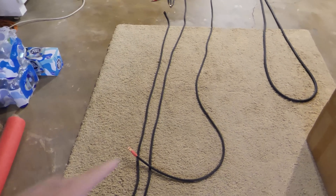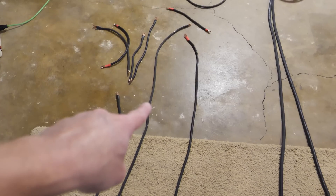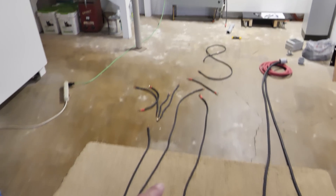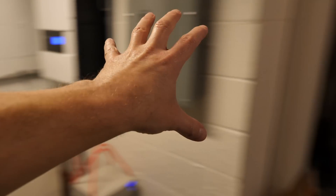Another thing I've been procrastinating on is the wiring. Right over here is the 2-0 wire, and right over here is the 2-gauge wire from the previous Powerwall. I've been redoing some calculations on how many amps I'm going to use, and what I think I can do is use the 2-gauge wire because I just have enough to go from the bottom box and the top box over to the metal box going right over here. So if I just go with the 32 cells and not the Rhino or the Husky or anything like that, over to the 12,000-watt inverter, the max draw if I'm drawing 12,000 watts is 250 amps.